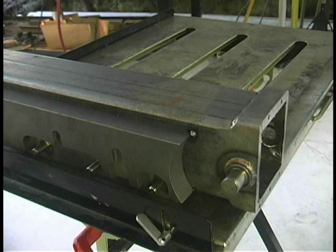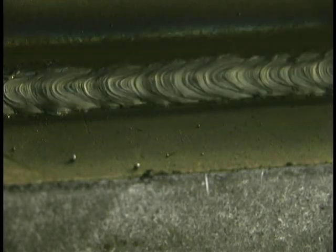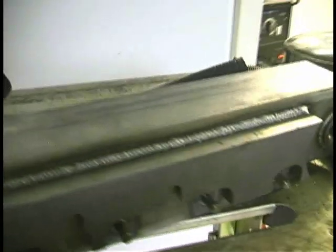I made that weld a little bit smaller because I'm concerned about making sure there's enough clearance for that stainless steel pulley wheel to fit in there without having to rework, machine, or grind it down. The main weld on the top of the side plates is the one that everybody sees, so that's the one I want to make look the best. I'm using a series of cursive E-type motion — or an ocean wave — to make a nice rippled pattern that's pleasing to the eye. People tend to like it better than a smooth weld with tight ripples. When this thing's all plated, it really pops at a show when they're displaying it.